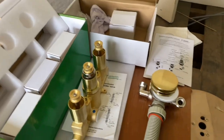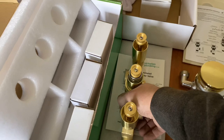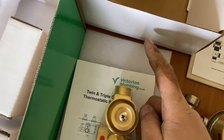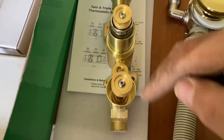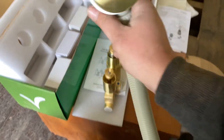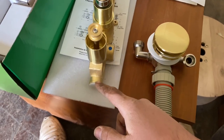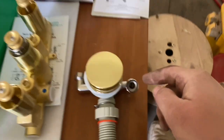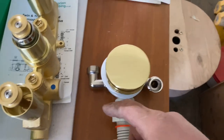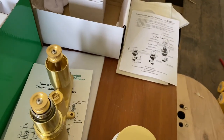We're now looking at the fittings for the shower and the bath. This valve is going in the wall — flow off the top, that fitting off the top goes to the shower head, hot in on the left, cold on the right, and this one comes off to fill. They've got a bath filler, so that fits to the bath. It's got two inlets for taps but with this one it's mixed water coming out of the bottom of the valve straight into that, so I'm working out whether I just take one of them out and cap it off and use one, because we only need one inlet since it's mixed coming out.